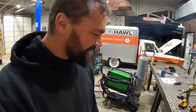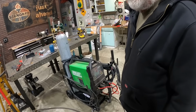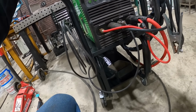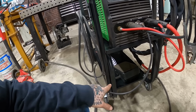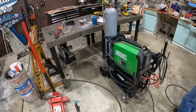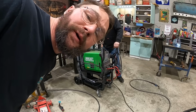I'm in trouble. So when you put it on, you could fasten it to there, and that would stiffen her up. Yeah. Give that the old skiing test, Bill. Shake on that for me. Y'all see how much flex is in that? I'm gonna grind down in here and then just put some weld down in here and just kind of stiffen this front end up some. The back doesn't do it as bad. I may grab a weld or two back there, who knows? I might get buck nasty and weld the whole thing.